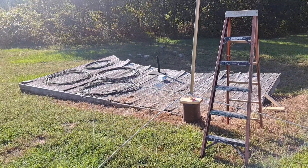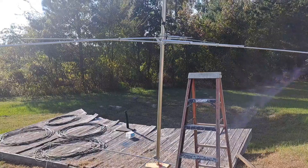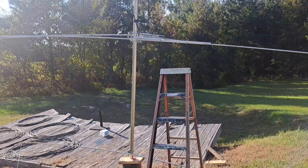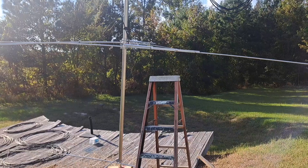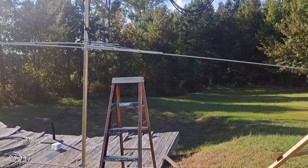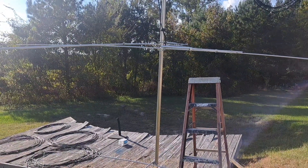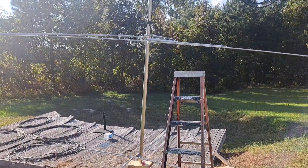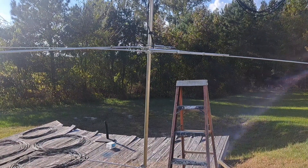What I'm doing is putting gamma matches on this Mako Shooting Star antenna and how to properly mount them so that they'll function. We're doing this because we want to maximize as much as we can with a stock radio — we want to use a stock radio, that's the legal limit, and you can do a lot with a little bit.